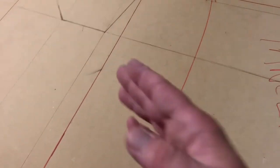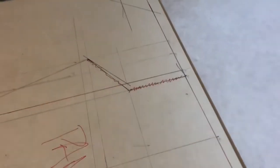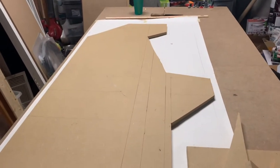It's only 1/4 inch. I'm going to use it as a guide so I get a nice straight cut along this line using a circular saw. Then I'll come back and do these other 2 cuts. And then I'll come back with the jigsaw and make straight line cuts, finish out the piece, and then I'll have a template to work with. And there it is. It's all finished up.